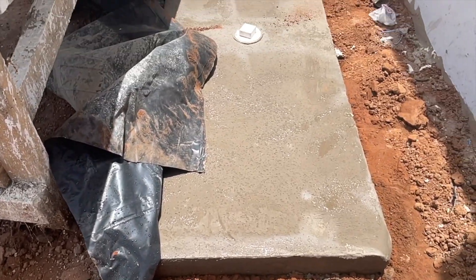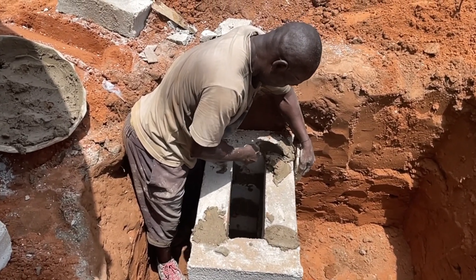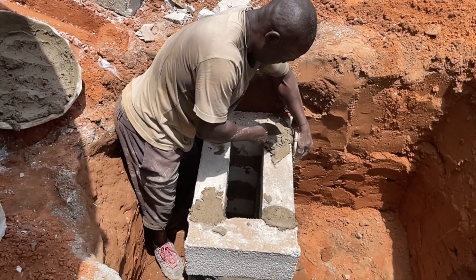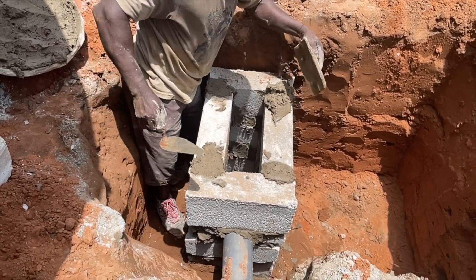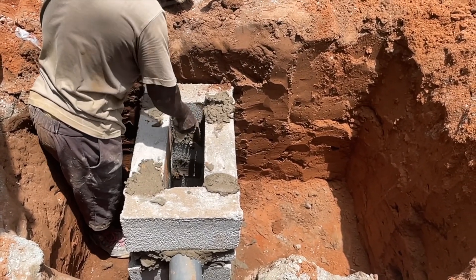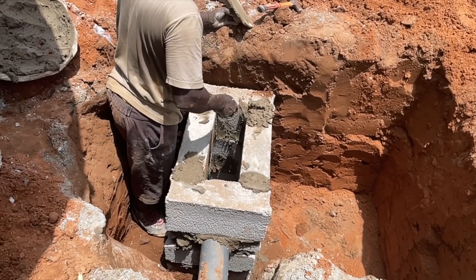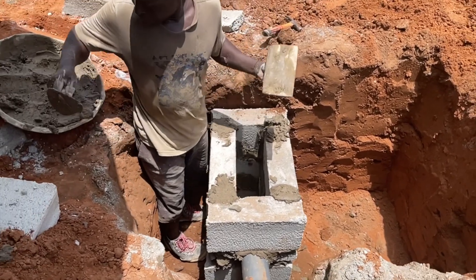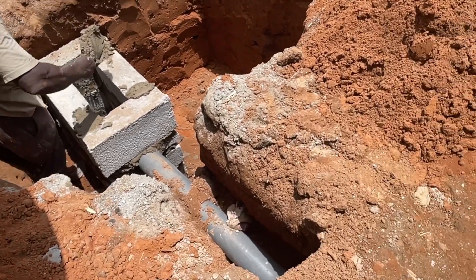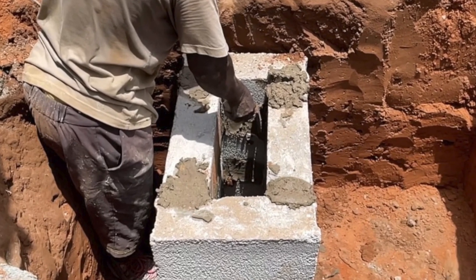You get some five-inch blocks — the same ones commonly used for biodigester construction — and lay them in such a way that you don't do any technical mortar work between them. Just a small space in between is enough to provide room for the wastewater to drop into it. The key advantage of this only works when the land is good and sandy and can soak water well; otherwise, if it's a waterlogged area, this technique will not work.